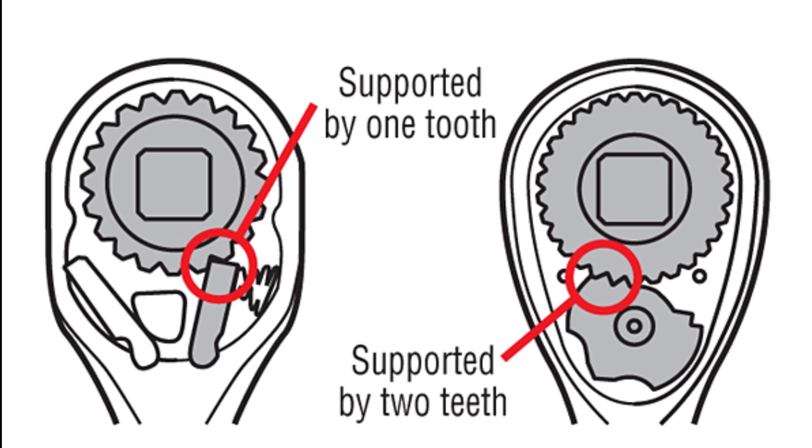This schematic shows the double ratchet system — or claw ratchet — and also the drive gear. The areas in red are the areas where typically you have dirt and lack of lube, and this is what we are going to fix.